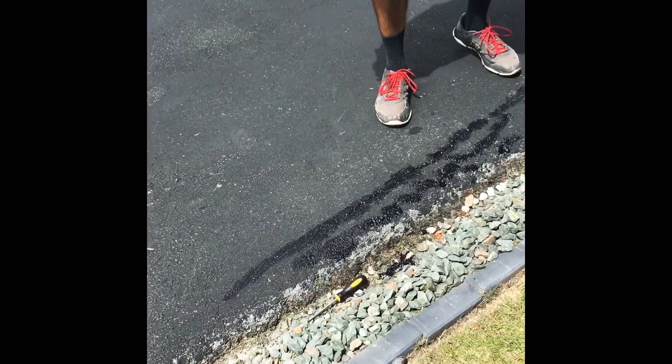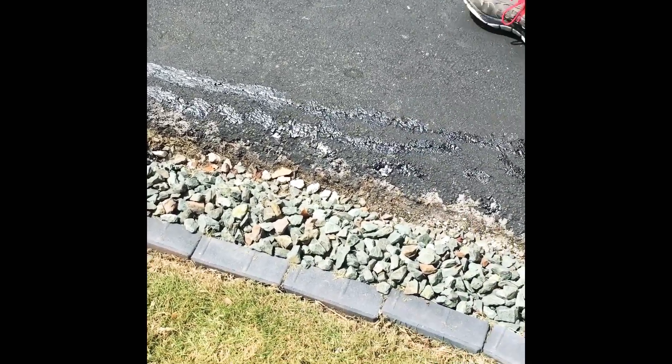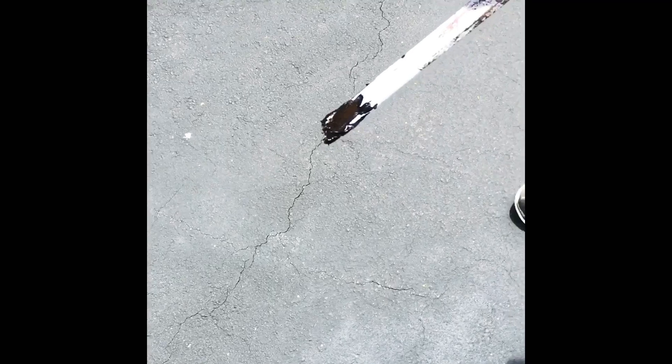If you zoom in and pay attention here, I came in and got some of the cracks. I'm coming around catching some little holes. The reason why I'm doing this is because that's where it opens up — the rain starts going in, it opens up and it ruins your driveway. That's when you start having flaking, little rocks coming loose, and you wind up with a hole. Here I got a few spots that were little cracks. This driveway is not that bad because it's not that old; we're just trying to keep up with it. Now if you come over here, I'll show you the beginning of the damage — you see that? That's a big no-no. You can see it drying out, cracking a little bit. You go in there and give it a little maintenance so it doesn't continue opening up. Water goes in, driveway starts falling apart. That's what we're going to do, and the next step will be trimming.